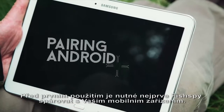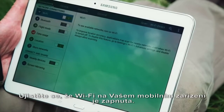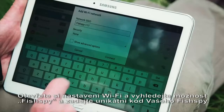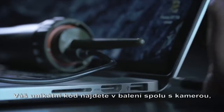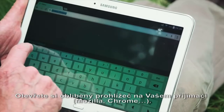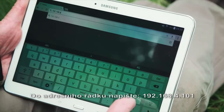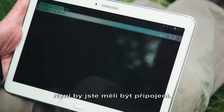When you first use FishSpy on a portable device, you need to pair it to the device. Ensure Wi-Fi is turned on on your portable device. Go to Wi-Fi options and type FishSpy, then the unique code of your specific FishSpy — for example, FishSpy-123 — then select Connect. Your unique code can be found printed on the card inside the box. Or simply connect your FishSpy to a PC to show your code. Load your browser such as Google Chrome and type in 192.168.4.101 in the address bar. You should now be connected.